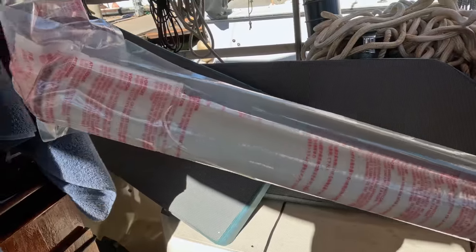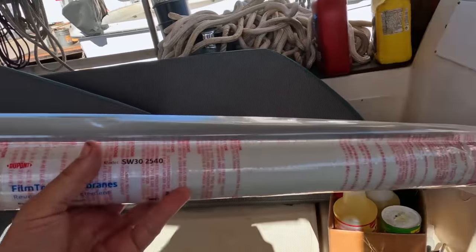So I should be pretty quick at this. I've done it several times now. It's the second membrane in line. I'm gonna pop it out, grease up all the rings again, and hopefully we make good water. It'd be amazing to have that settled. So I'm gonna take it apart now. This thing's about $280.